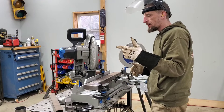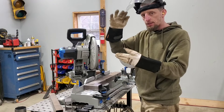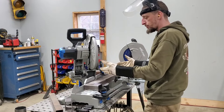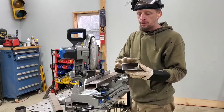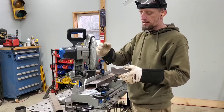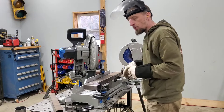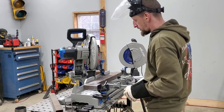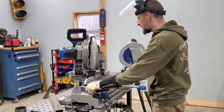That's absolutely crisp and clean — a perfect 45, nice and flat. That's where the clamping comes into play. The speed at which this cuts a 45 definitely outperforms my bandsaw. The only difference is the bandsaw lets you set the hydraulic descent and walk away to multi-task. However, in the speed this produces — within less than 30 seconds, and there's not even a burr on it. If you were in a production shop, you hit it with the grinder, clean it up, weld it together, and you're on to the next cut.